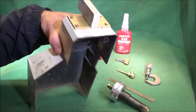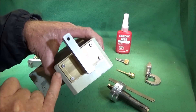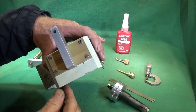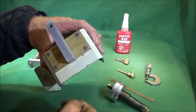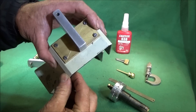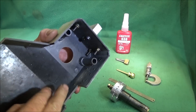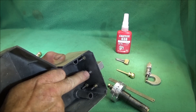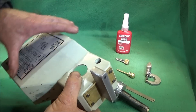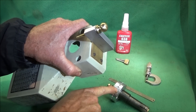For the locating pin assembly on the back, I've mounted it on the rear gear guard using a nice thick piece of brass, 3mm thick. I carefully marked it out so the screws would be in the correct position and nice and square, then drilled the centre holes. I put the brass on top of the guard, drilled down through, and bolted it on with four 4BA steel screws with brass nuts, then screwed the aluminium part up through. This part is for the pin to go down through to locate in the holes on the indexing ring.